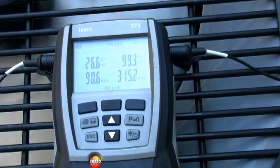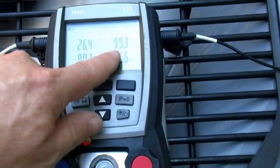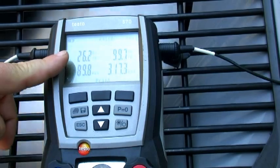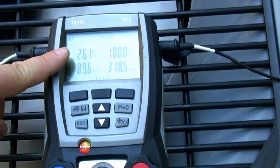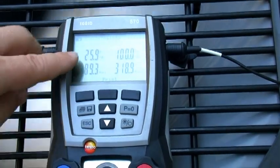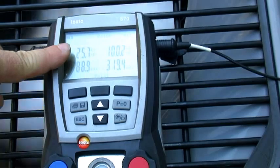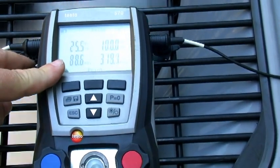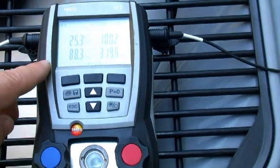I've had this running for a little bit and everything seems to be balanced out. Now my evaporating temperature is at 26 degrees and my condensing is at 99. You want to take your indoor temperature and subtract 35 — that should get you about where your evaporation temperature should be. My indoor temperature is 76, so I should be around 41 degrees, but I'm way lower than that. That's going to be a way you can tell if your coil is clogged. For R410A, you should never have anything under 100 pounds on the low side.